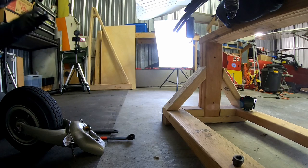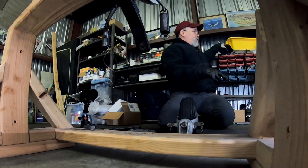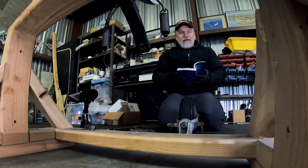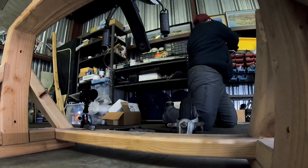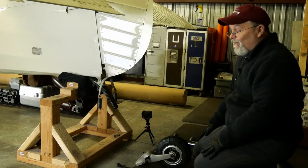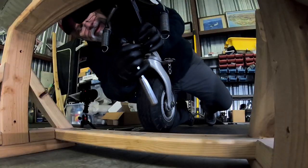And I can first tell you the torque for this thing is pretty mind-blowing. It's 400 and... If you don't have one of these, the Standard Aircraft Handbook is very handy. There's tons and tons of information in here. For a half inch 20 size bolt, we're going to torque this 480 to 690 inch-pounds. If you go in the middle of that range, 585-ish, and divide that by 12, you come up with 48 foot-pounds. So that's what we'll be torquing our bolt to. Snug.